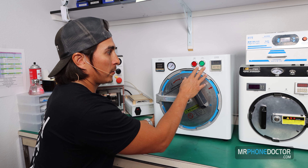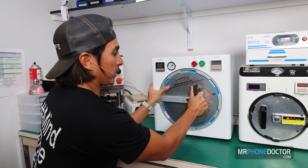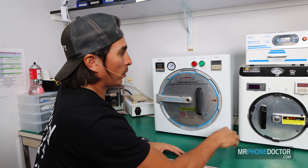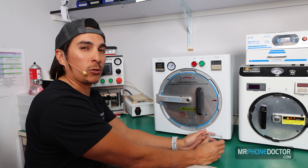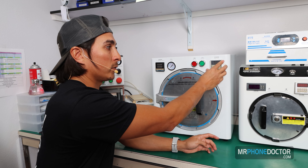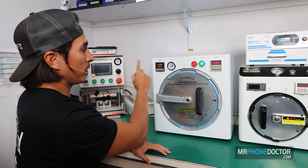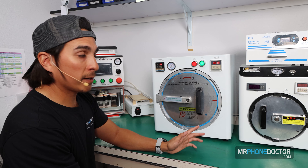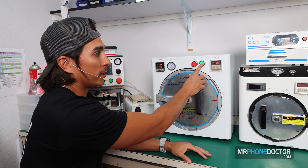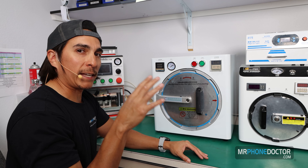It does have two separate elements here — you have your heating and your start. You always want to make sure that you close this door anytime you're going to run it. Just slide this down and hit start, and that's going to start the autoclave process. Normally for this larger one, we're only going to be doing tablets, so you don't want to autoclave longer than two to three minutes, depending on your bubble issues. Hit start and hit heating, and the heating will turn on the coil and allow it to get up to 50 degrees Celsius. If you want to stop it, just hit the green start button again and that releases all the air, then turn off the heat. You can actually run with heat on or heat off — that's something we're going to have to play around with.